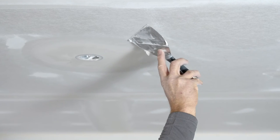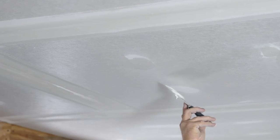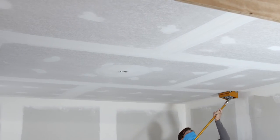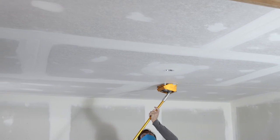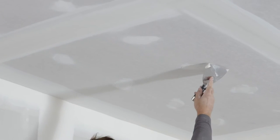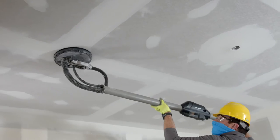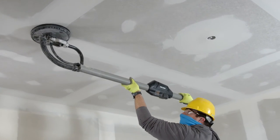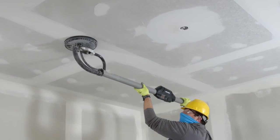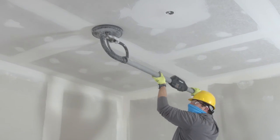Spot fill the field screws again, this time using ready-mixed lightweight compound. When the compound is completely dry, apply a second coat of ready-mixed lightweight compound to the joints with a taping knife or box. Keep the finish width of the joints to no more than 8 inches — wider joints will reduce the acoustical performance of the ceiling. If needed, spot the screws a final time. When the compound is dry, lightly sand the seams and spot fills with 220 grit sandpaper. If you use a power sander, start at the slowest speed setting and apply gentle pressure to avoid sanding through the face of the panels.